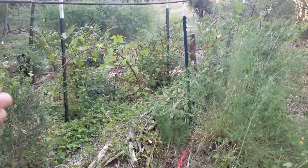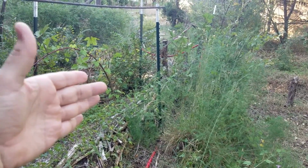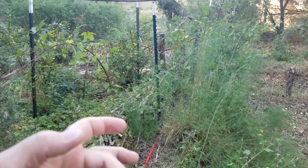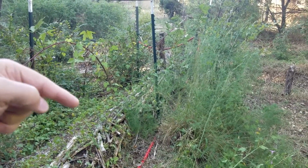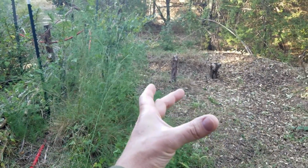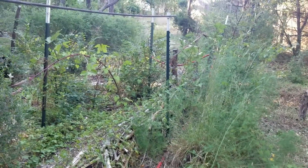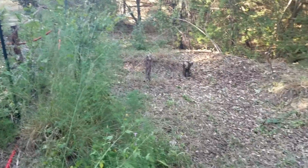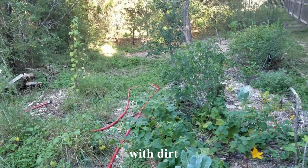Ideally, though, you would have none of this flowing in. It would flow into about here and hit a barrier, and then it would flow around the pond, in that direction and this direction. And due to making the water stop and flow around and along the edges of the pond, it will seep and actually percolate into the pond without any sediment. That'd be the proper way to build a pond down a hill. You don't want to have any major inflow into a water body like that. Otherwise, it will fill up eventually.